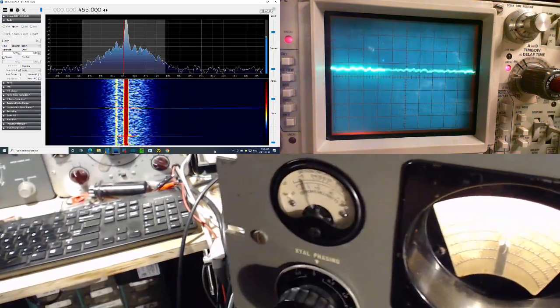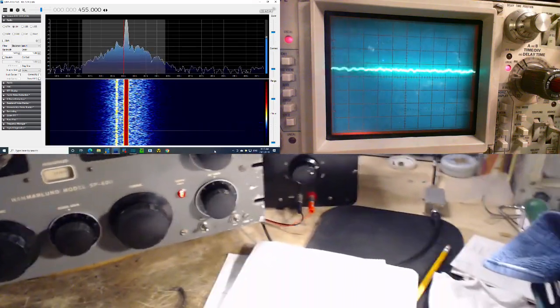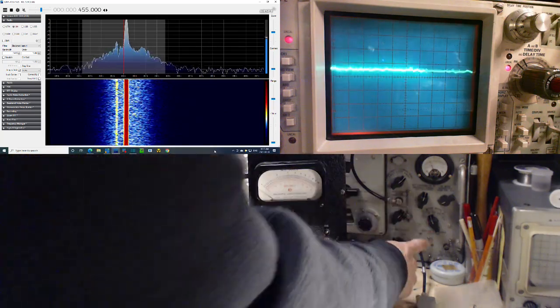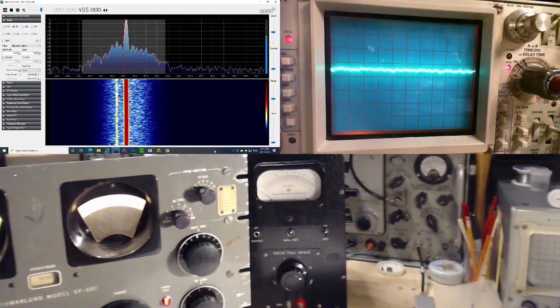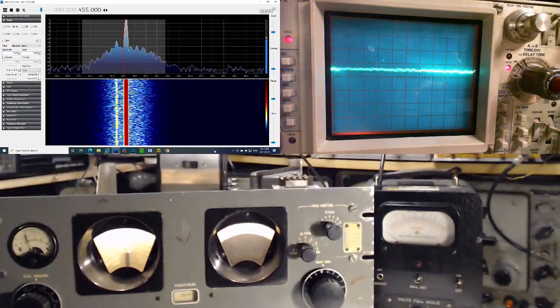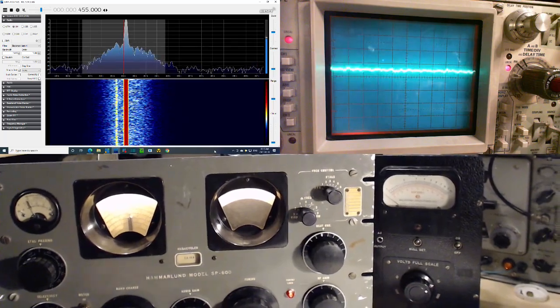Now, it's questionable, and it's reasonable to question this. The signal generator may well be calibrated to produce exactly 3 microvolts here, but what's getting right to the radio is debatable. Can't be more? Can it be more? I don't think it can be more unless you have some really weird resonance thing going on. So it's bound to be less. It's quite a bit less.